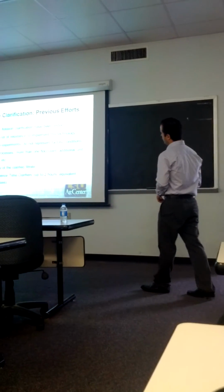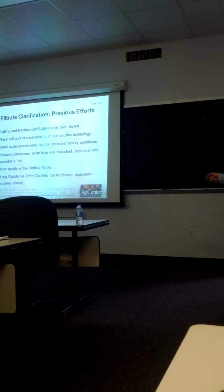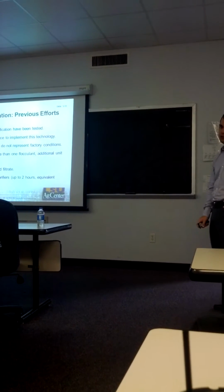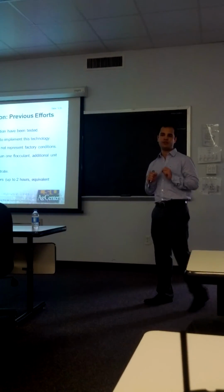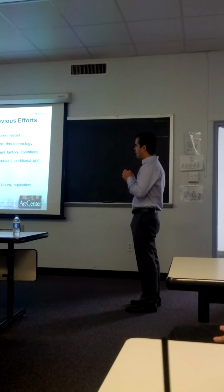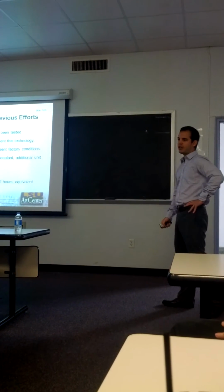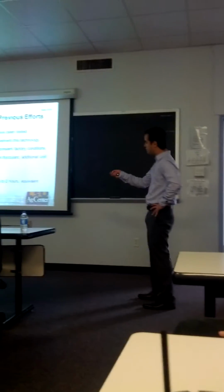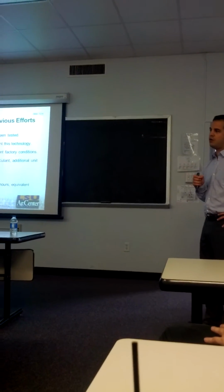To avoid this recirculation, several alternatives have been proposed. The most popular one has been the clarification of filtrate either by flotation or settling, but there's still a lot of resistance to implement this technology because, basically, the reasons I found is that the studies that have been conducted were small-scale experiments that did not represent the factory conditions.